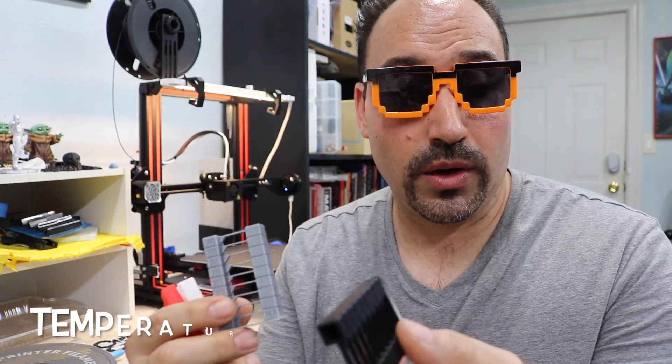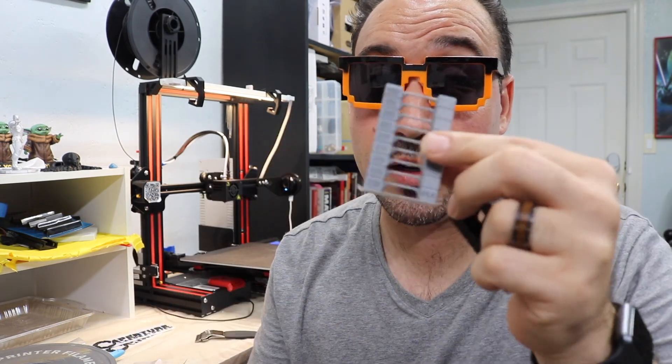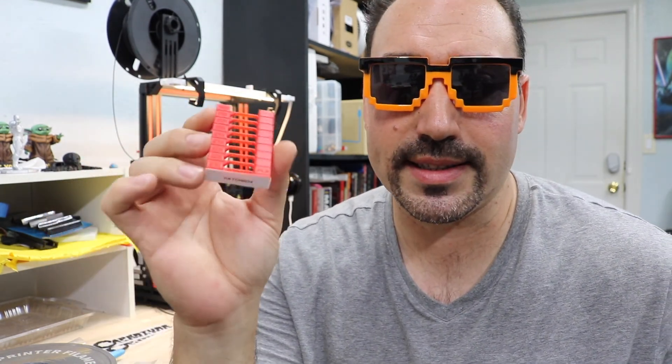Let's see if the temperature's on the box. In this case, the temperature's not on there, and that's why I wanted to show you this today. They usually give you a range of temperature to work from. This is PLA, and it's usually between 200 to 230. What I like to do — and I have quite a few here — is make these little heat towers. This one's Overture, that was really good. This is Hatchbox Silver, this is my favorite. This is the TechBear White — you had to work at a higher temperature, but it wasn't bad. And this was another Hatchbox — it was really good, but not as good as the Silver.